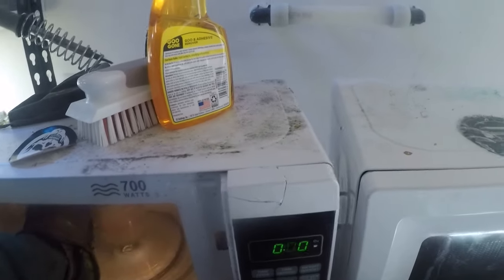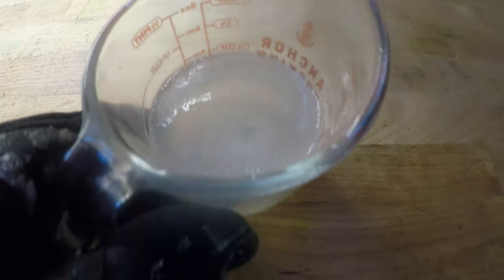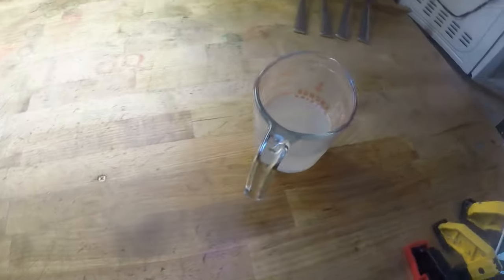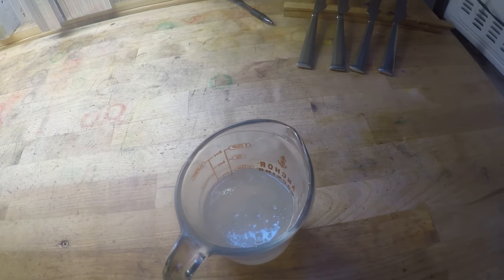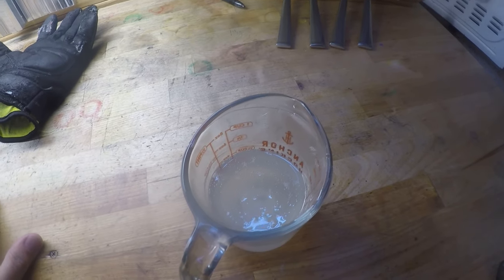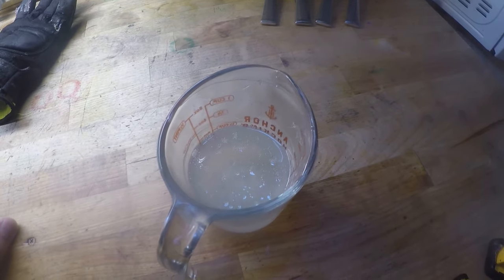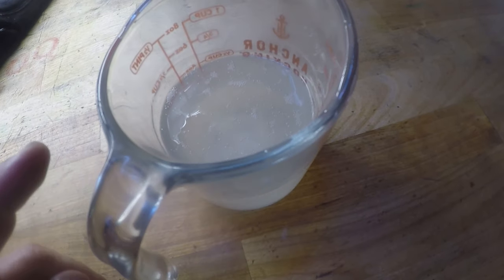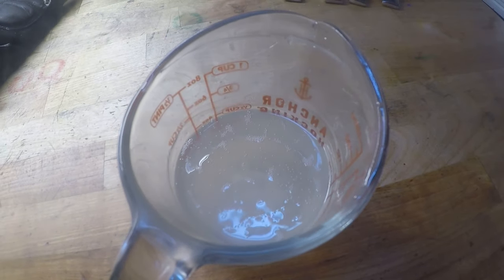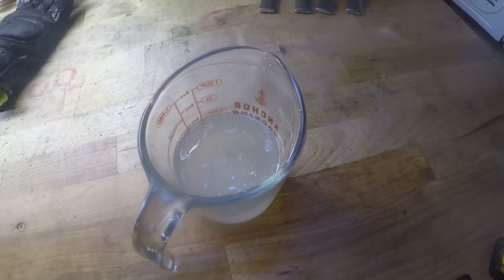All right, that was 2 minutes. Now it looks completely clear. You can see a good amount of bubbles are in there. But now, what was the point of heating it up? You have to get plastisol. I've never seen a brand that didn't require you to get 350 degrees initial heating. At 350 degrees, that liquid makes a complete chemical change, and it turns into a whole another product.